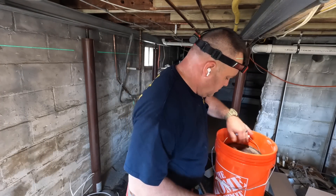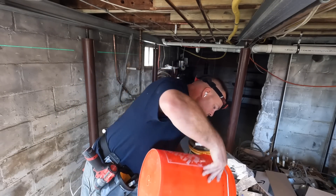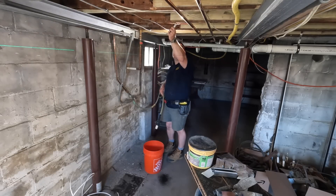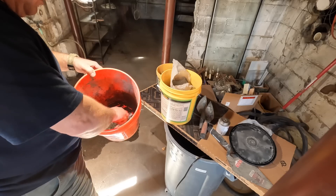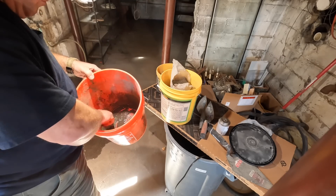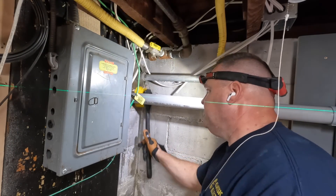I'm using hydraulic concrete — it's a leak preventer. I'm patching up around the hole I made in the cinder block around the PVC conduit so no snow, water, or rain gets into that hole. Before applying the hydraulic concrete, I want to get the area around that hole wet so the concrete adheres to the wall better.